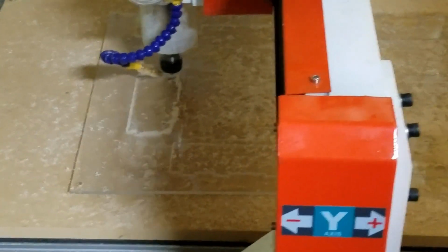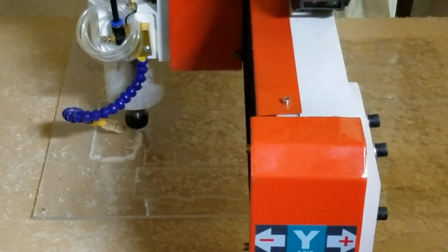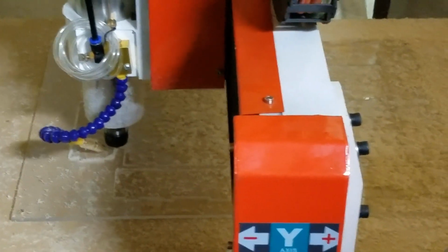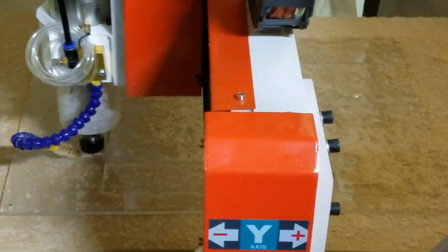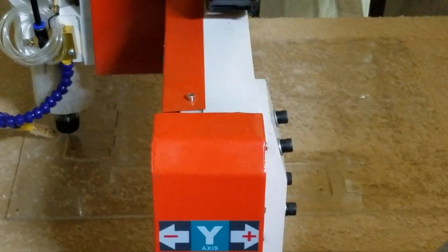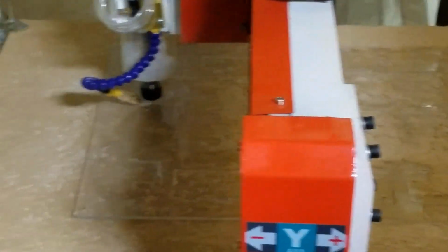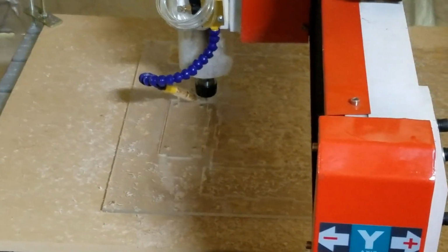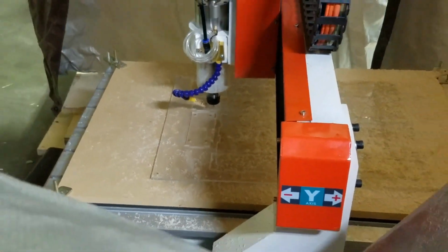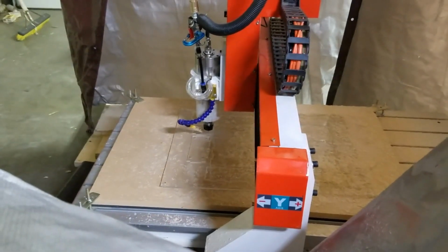And yeah, you can hear it quiet down because it's going to do the finishing pass now. And I've just done like a 3/1000 inch step over for the finishing pass. Doesn't need to be too much of a finishing pass. Really, the point of this mostly is to clear out the extra chips and give itself a better surface finish for the spring pass. But yeah, it's doing a pretty good job so far. And there it is, all finished. So I'm going to go ahead and unscrew all of those, and I'll be back soon.